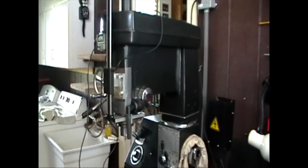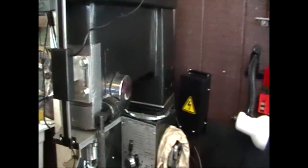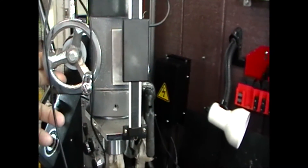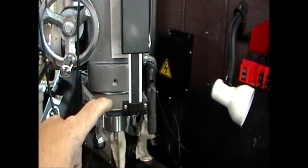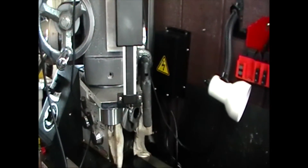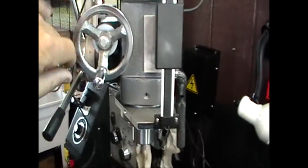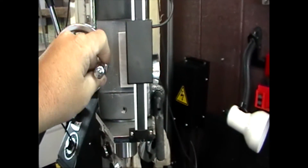My digital readout does work now. One thing I want to add — and I will do a video — is to bring a piece of aluminum across here, because this does not have a drill stop or depth stop. I have some threaded rod I want to thread close to this corner, and it'll run straight up. I have to figure out where to put the two nuts to actually stop the quill from traveling down — it can't go in this area because of my precision adjustment here; it might get in the way. We'll visit that on another day.